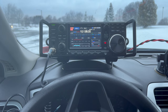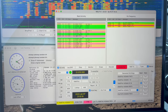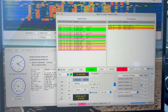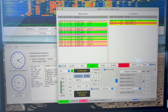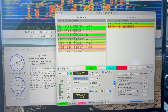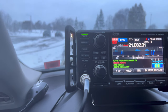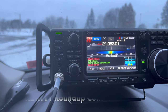We're getting about half the power out — flat SWR, no ALC. Now tuned up on 15 meters in emergency mode. Like with 60 and 30, we're limited to 50 watts out, but that's more than enough for FT8. Doing a park-to-park here with KM6TAU — boom, park to park on 15 meters.